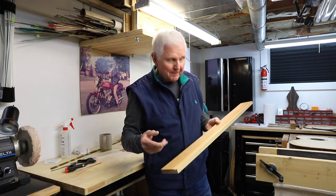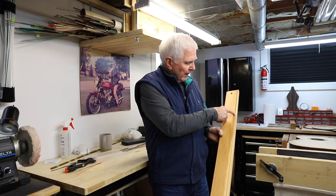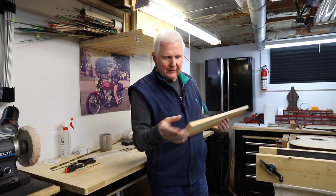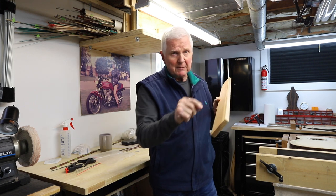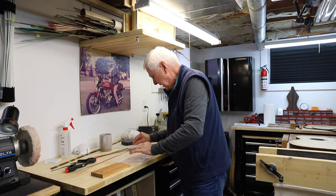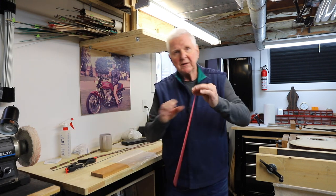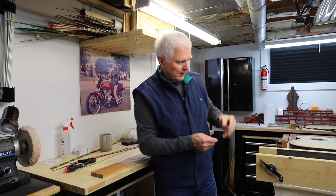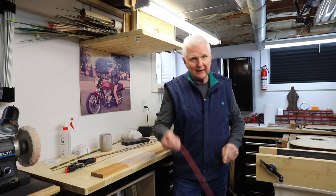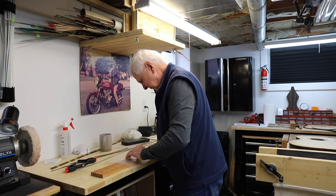If you don't have a skill saw and you don't have a table saw, find somebody that does, or get a router and do several different depths of cut because you don't want to run a router bit that deep — you want to do that in little bite-sized pieces. Alright, so what we do is we take some glue, get it on our finger, and just pull it across like that, and there will be glue on that little red piece of purfling that is twenty thousandths of an inch.